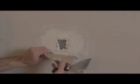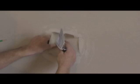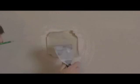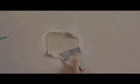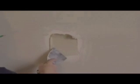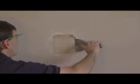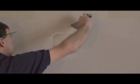After applying generous amounts of drywall compound, gently place your patch in the hole, allowing your knife to flush the drywall patch up with the surrounding surface of the drywall wall around it. Do not press too firmly in the center as you'll push the patch into the hole.